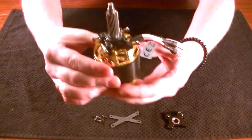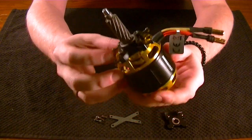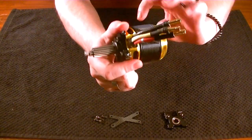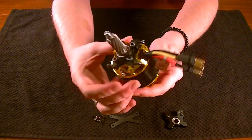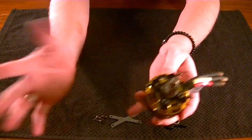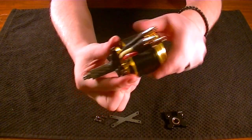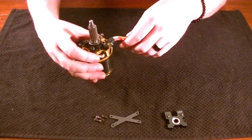We went ahead and got everything fastened down. Everything is Loctited and torqued appropriately. I went ahead and took care of the two grub screws to fasten down the pinion. Everything is perfectly smooth — no notching, no binding, no weird behaviors, no weird sounds. It should be that perfect. If it's not, reassess your build and start from scratch. Don't proceed if you have any sort of questionable doubt that something feels weird — find a way to fix it because it should be perfect.